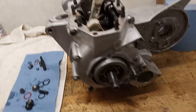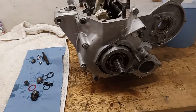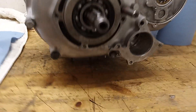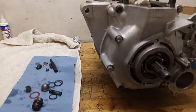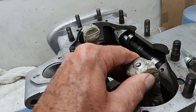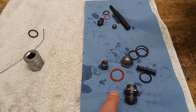The cases are together now, taped up, cleaned, excess well seal removed, so they're looking nice. Everything's running smoothly. Next I'm going to fit the oil pressure relief valve and the anti-drain valve, also called the anti-wet sump valve.